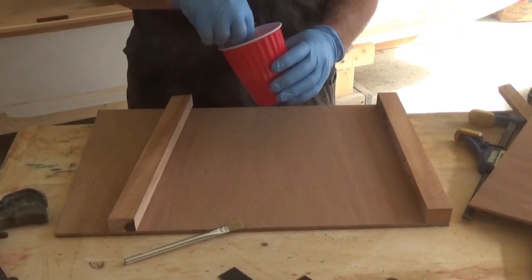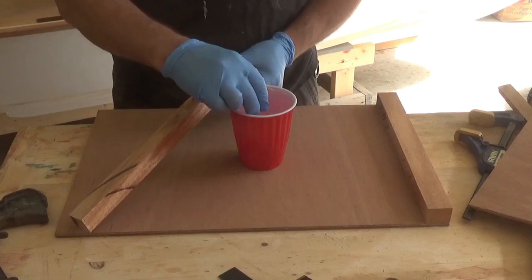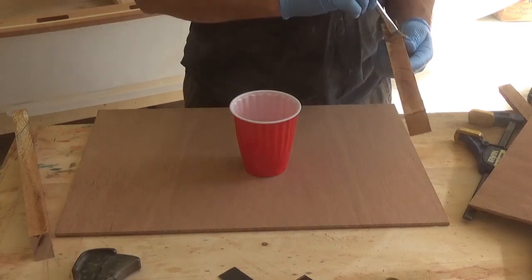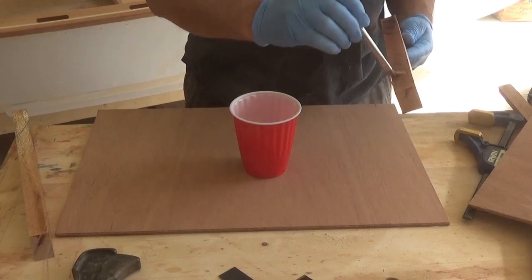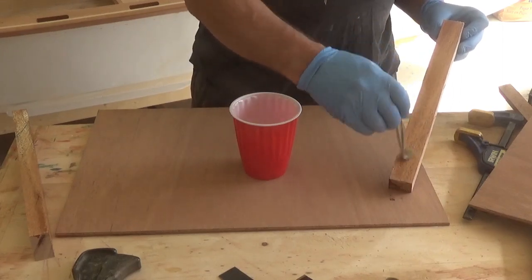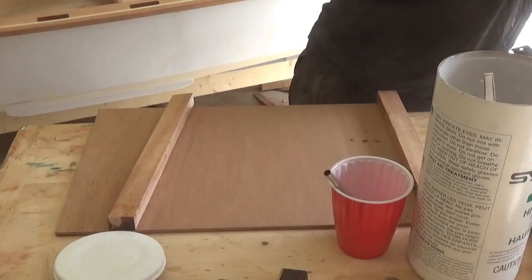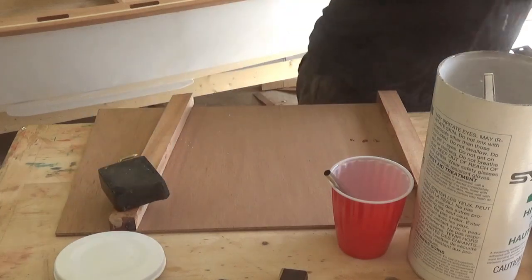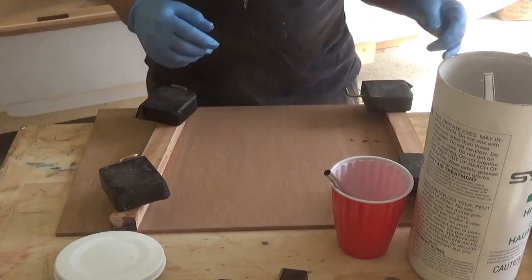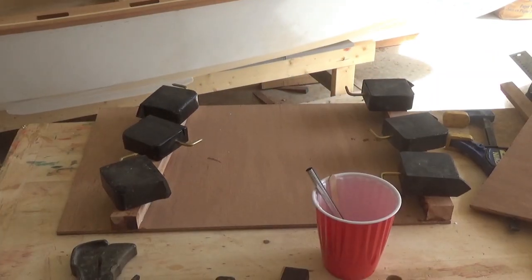I think I'm about ready to do this. I'm going to glue some pieces together — brush the inside of that and the back side of this. I'm going to glue on one side, epoxy coat it all, epoxy coat the other panel, and then glue it on. I'll just put some weight on there. It's a fast hardener, should set pretty quickly.